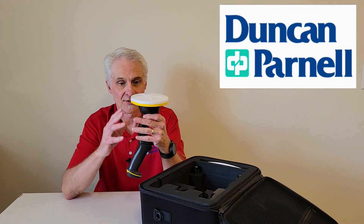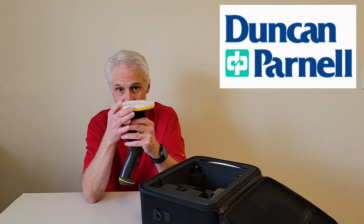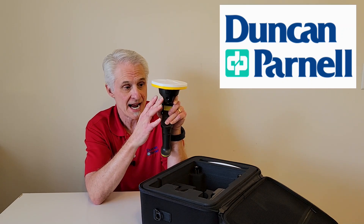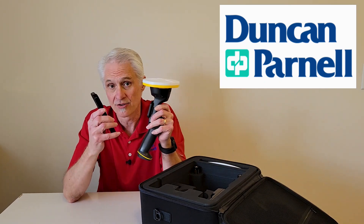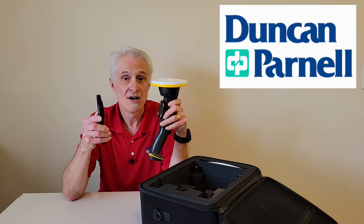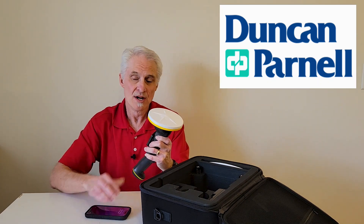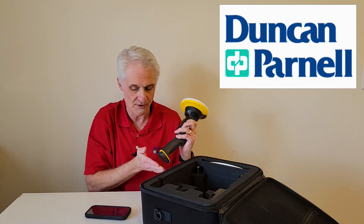So what is it? The HPS2 handle starts off with a DA2 antenna built in, so you've got a survey grade GPS antenna up top. It also has a very accurate EDM — plus or minus three millimeters at 100 meters. And then you control it with a phone. You can use an Android phone or an iPhone running either Trimble SiteVision software, which we're going to look at today, or Trimble Teraflex, which is more of a mapping and GIS software. It also comes with a couple of batteries that run about two and a half hours each, fitting right up in the bottom of the handle.